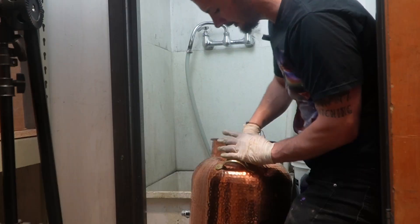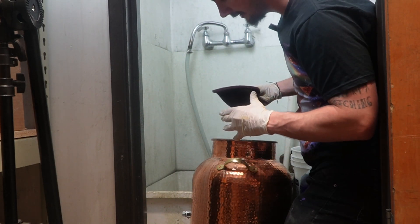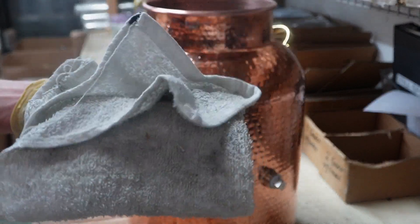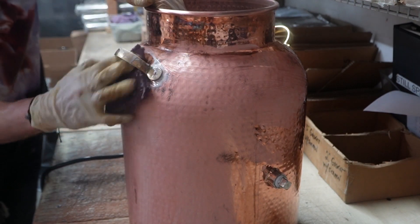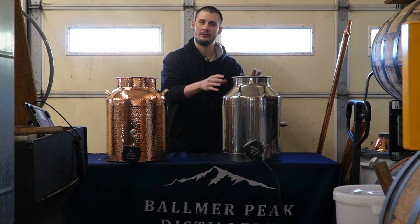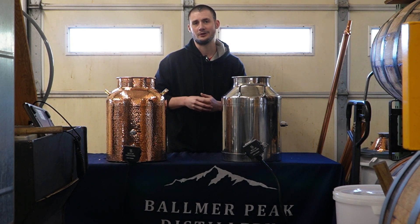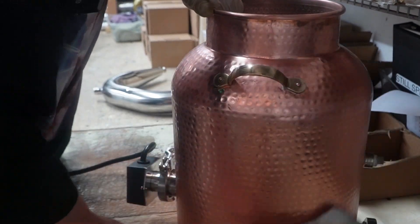With stainless, usually just a quick washout and a quick rinse-down and it's good to go. With copper, there's a process involved. Even getting this video set up for you guys, it was pretty obvious which material was going to use more time. The stainless took about maybe five minutes to get ready for this video, while copper took closer to 30 minutes, scrubbing everything down on the inside, removing patina.